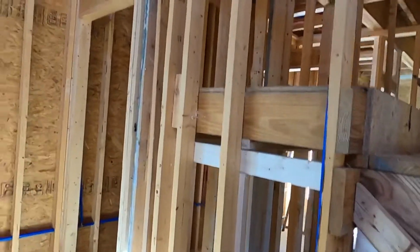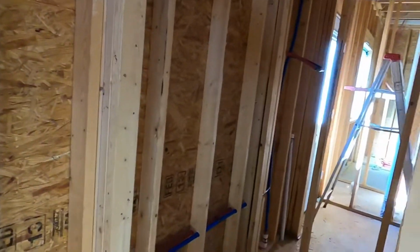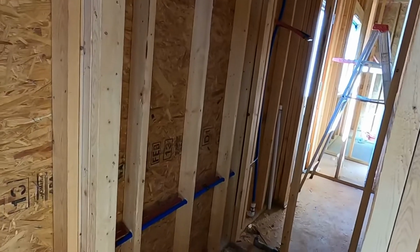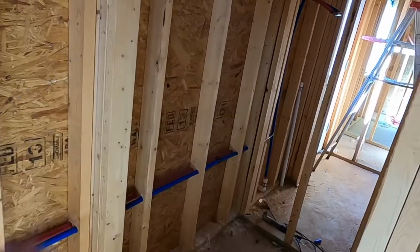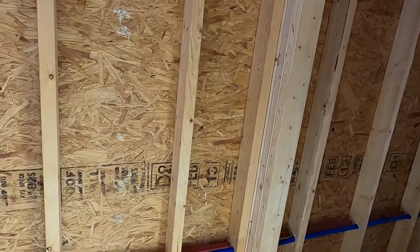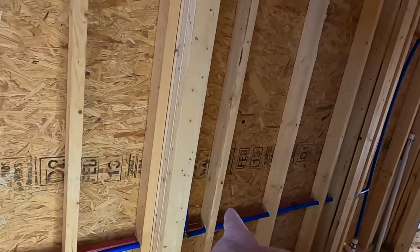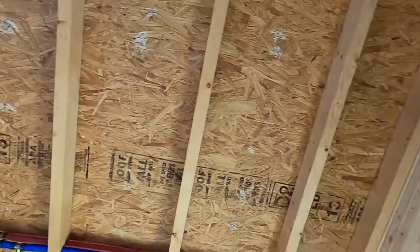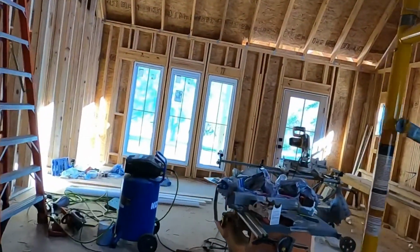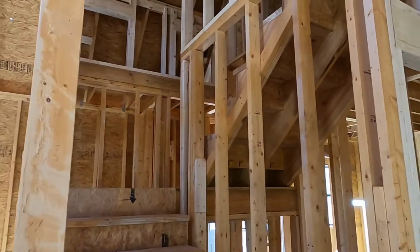Oh yeah, it's funny. These lines, I couldn't get them to go through the holes. Of course, I drilled them initially the same size as the outside diameter of this pipe, and it had a little bit of room in there to flop a little bit. But once you get through 2 or 3 boards, it was like pulling teeth, it would not move. So I had to pull them both out, and I had all the holes drilled, so I had to drill all the holes again. I had a 7/8 the first time, and then I went with the 1 inch the next time, and they would just go right in. So no problem.